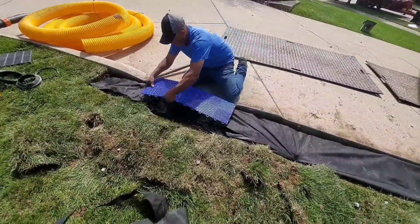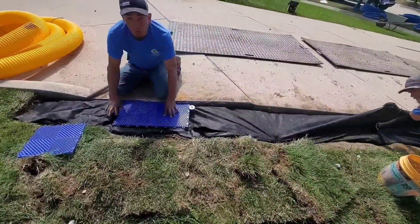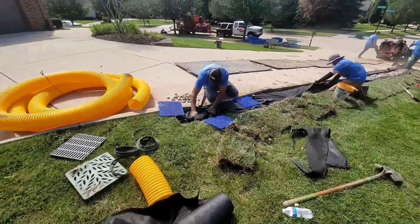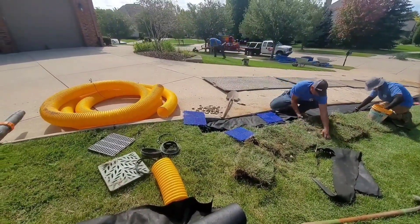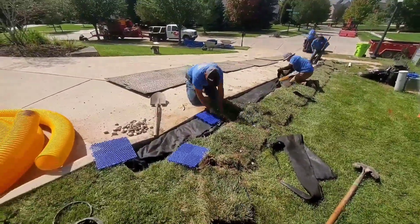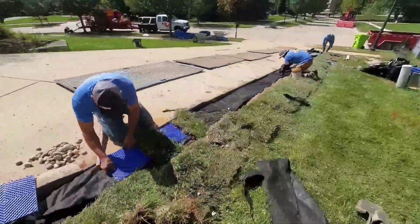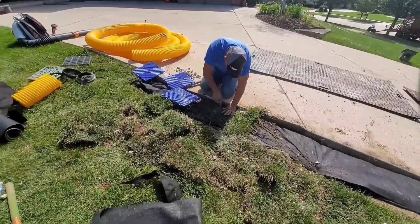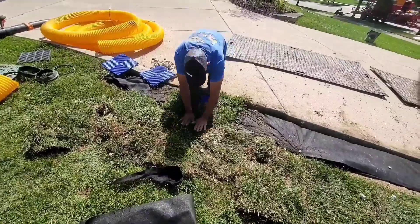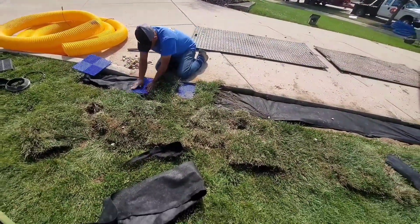Francisco is going to put some blind inlets in here alongside the drain basin the guys kept - this gives it more inlet capacity. When you're trying to grab up surface water, blind inlets are the way to go. You lay this right on top of the non-woven geotextile filter fabric, then take sod and piece it around it to hold it in place. The roots grow through all the holes punched in the fabric, and then water moves incredibly fast. The grass is going to grow right over these blind inlets - we don't care, because at that point we're going to have capillary action and gravity in our favor as water follows the grass plant roots right into our french drain system.